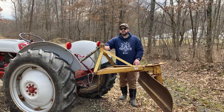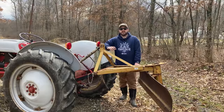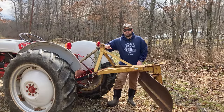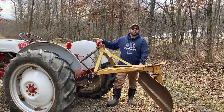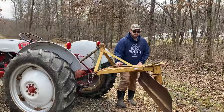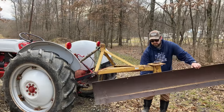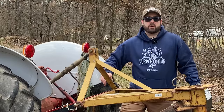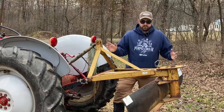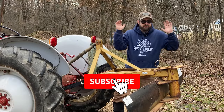I watch other YouTube channels and I know people like Mike Morgan might tell you that a land plane is the best way to level your driveway. That may be true — I don't have a land plane, and I don't have the $1,500 to buy one right now. What I do have, and what a lot of people have, is an old back blade, because most old farm tractors, if they had no other implements, had a back blade. This Ford 8N has a back blade — simple, with just a pull pin, adjustable, and it does swivel all the way around so you can angle it backwards. A box blade probably works well too for fixing driveways in the springtime, but that's another thing I don't have. So today's video is about: if you've got a tractor with a regular back blade, can you use it to fix the driveway? Absolutely — people have been doing it for 50 to 100 years.